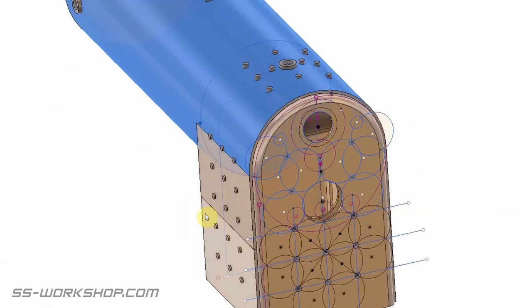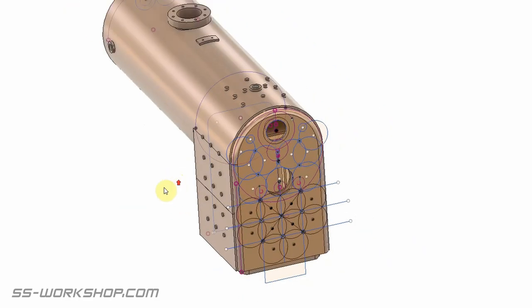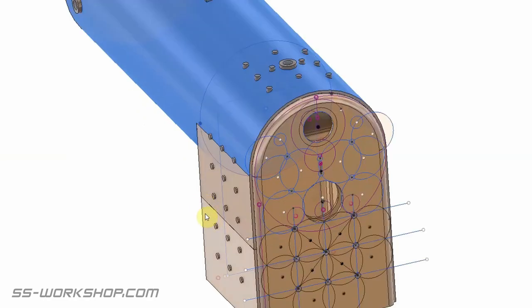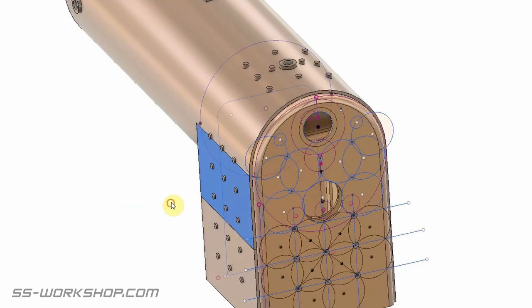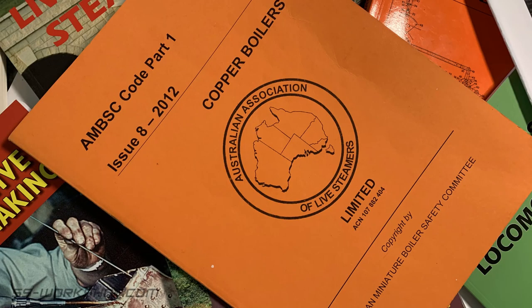During this process, attention will need to be paid to the boiler and valve gear, as neither scales directly from the prototype. The boiler will likely need to be designed to meet a standard — in my case an Australian standard put out by the Australian Association of Live Steamers. This sets the thickness of the boiler, the stays, and other design parameters. Your boiler design will then need to be checked by your club boiler inspector, undertaken prior to and during construction, and finally it'll need a pressure test before it's run for the first time. If you don't go through these steps you'll end up with a locomotive you can't run at a club, so I recommend you research this well for your own area.